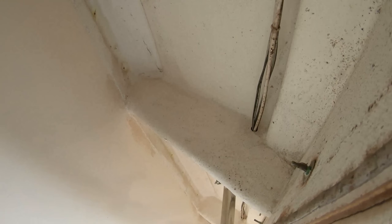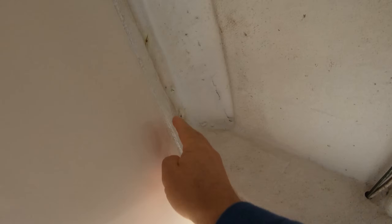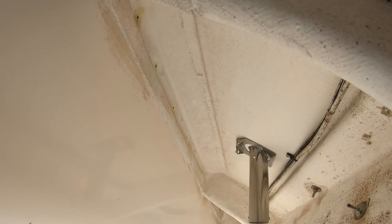I want to talk about the construction — it's a three-piece boat, meaning there's a hull, deck and liner, and a cap. On this boat they bond the cap to the hull, deck, and liner with fiberglass and other types of fasteners. As you can see, it's bonded well here — heavy glass. I think it's 1808 up in there, probably some 1708. That's what makes these boats so strong. They do an incredible job in the manufacturing process, putting these things together and bonding with not just fasteners but also fiberglass mat.